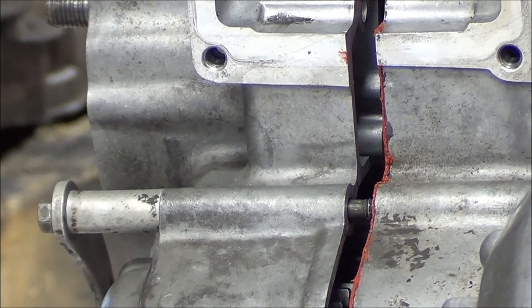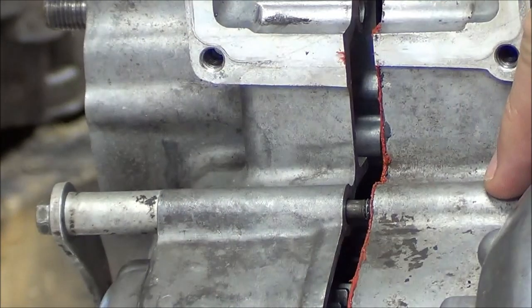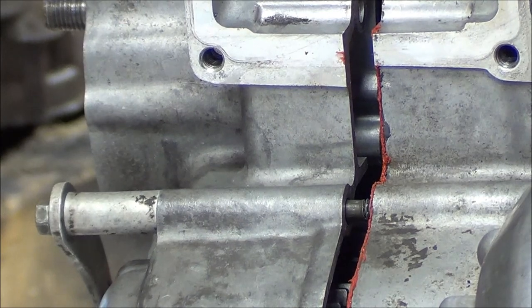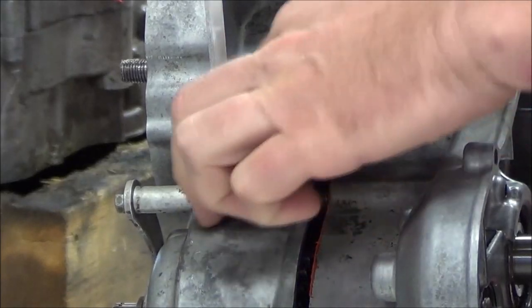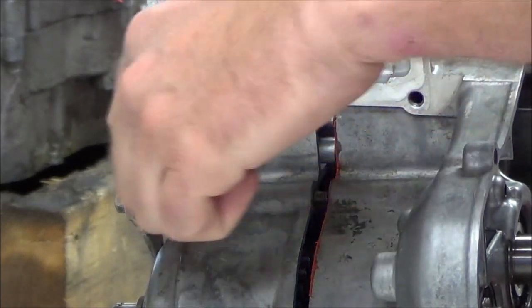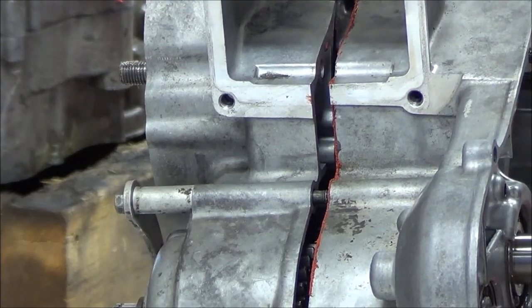Not looking on the other side — losing some confidence in the service manual and microfiche? Josh, when I look at this imaginary line, do you see these humps right here? What do we call those? Those humps — back the camera up a hair. Do you see this bolt going through here, and this hump of this boss and this casting? Wouldn't that tell you this bolt would go all the way through? Yes. When in doubt, take that fastener out.